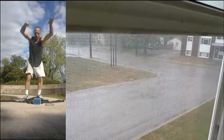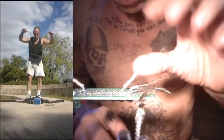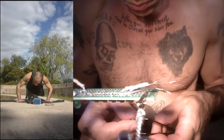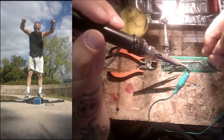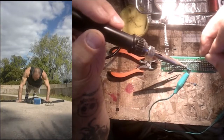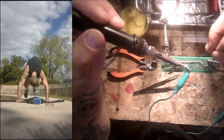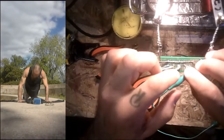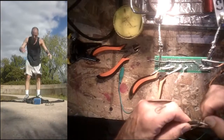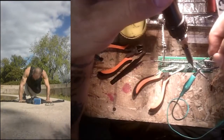It was a rainy day in Moncton and I was bored. Since I'd gotten a bunch of new widgets in the mail, I decided to make an Arduino project. I got to my workbench and put together a voltage divider button controller — essentially a bunch of five buttons in parallel, each with their own resistance, and their resistances are in series with a common resistor tied to VCC.